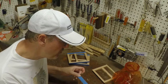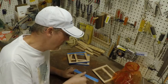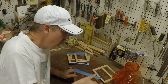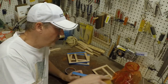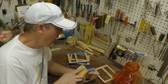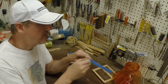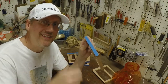The precision was something that was just harder to get. Now what I do is when I put the masking tape down and make sure that it overlaps all the edges, I take my sanding block with 220 grit sandpaper and give it two, maybe three strokes at all the edges. And when I'm all done, the paper comes off perfect every single time. Thanks, have a great day.